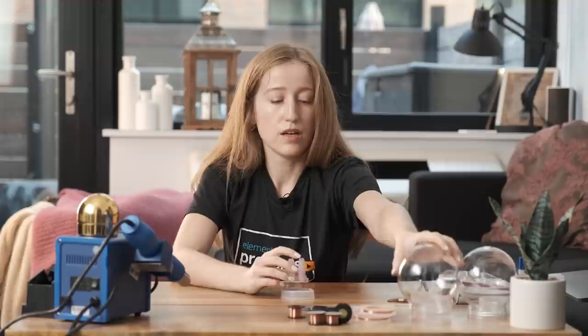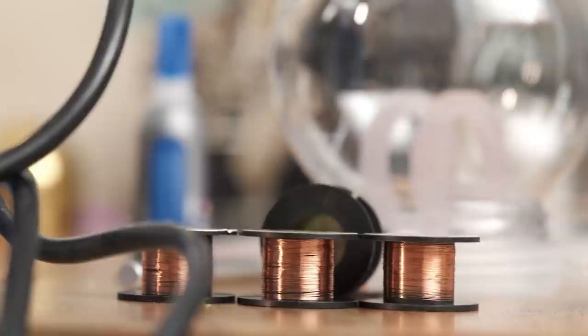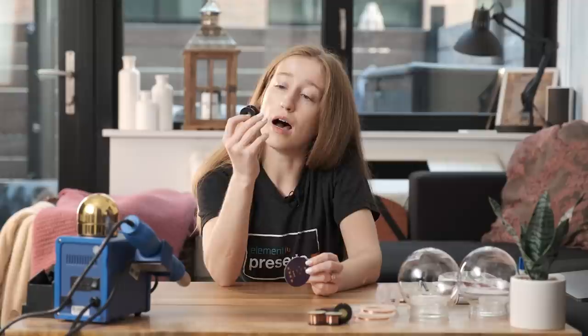For the current driver circuit, I did a really quick and dirty current source circuit, which is simply an emitter follower transistor with a Zener diode that should keep our current around 20 milliamps, which is just below the capacity of my magnet wire at 0.1 millimeter in diameter. We'll solder that up, and we've got our battery as a power source that will all fit into our cavity and then into our snow globe.